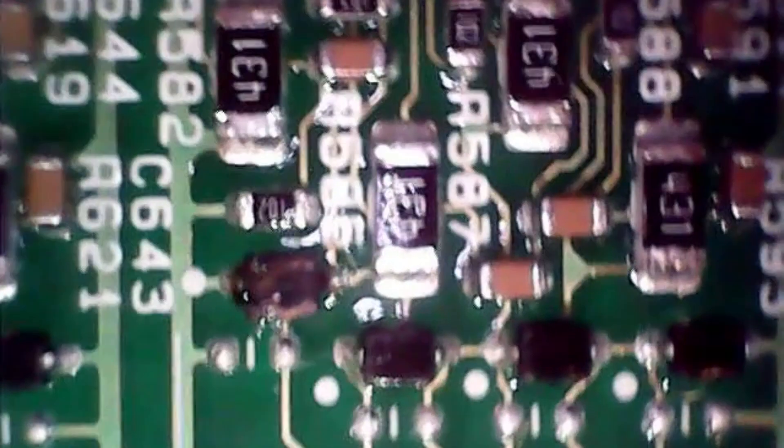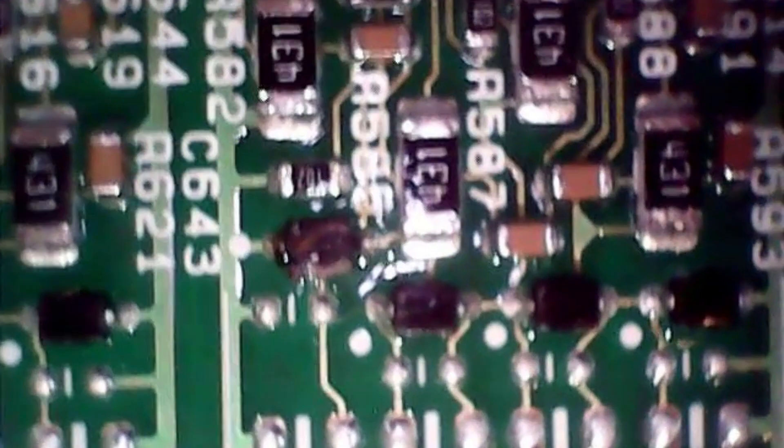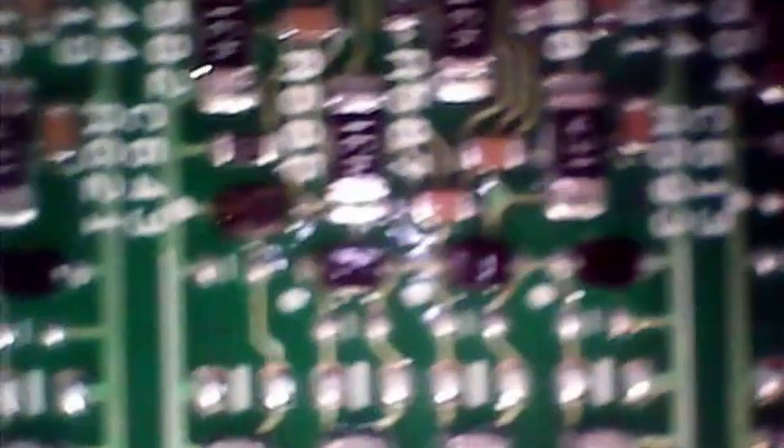I'm going to show you a little clip now of some 3D work I've been doing and how the project is progressing. First, a close-up of the damage to this BMS. You can see a Zener diode pretty much in the middle of the picture that's kind of expanded, and it's that that's caused the little scorch mark on the plastic. So I need to get that replaced. All the other Zener diodes here all look fine on this group and the group next to it. As these chain together I'd have expected problems on the adjacent ones as well, but nothing appears to be too badly damaged or damaged at all.